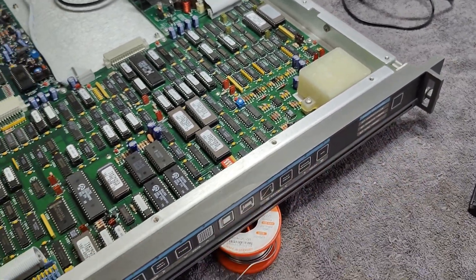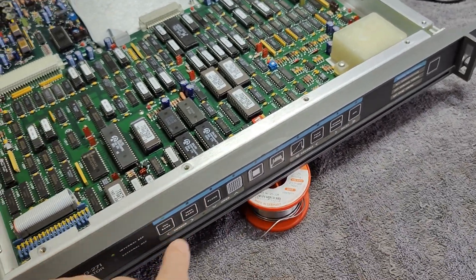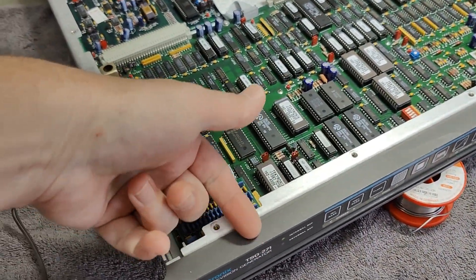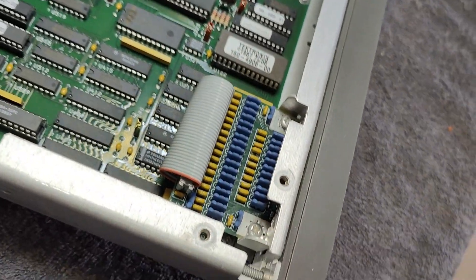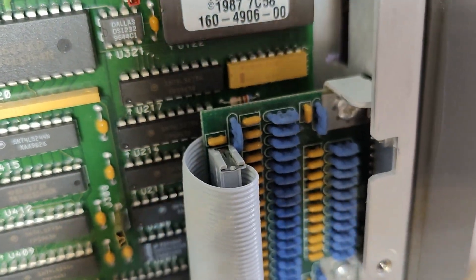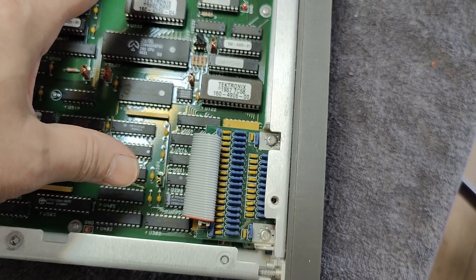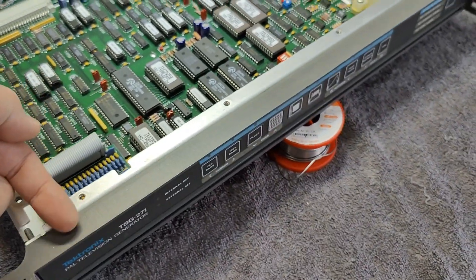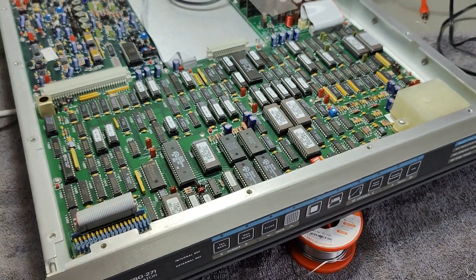This entire front panel with all the different switches and LEDs - there's of course a thin circuit board in here. Let me turn this off - it's annoying. Look at all those feed-through filters. That is so all the nasty noise from the internal parts is not going outside of the metal cabinet and becoming an antenna out there, so that is of course important.